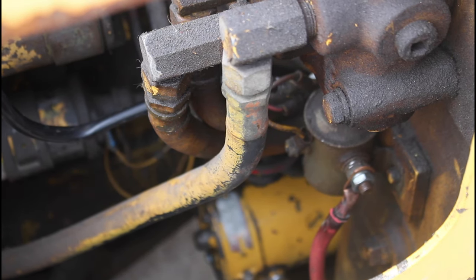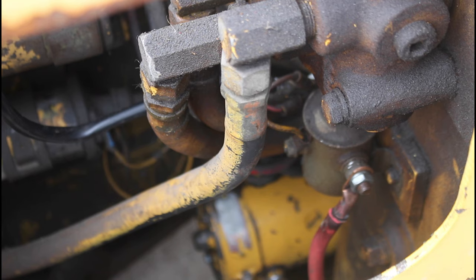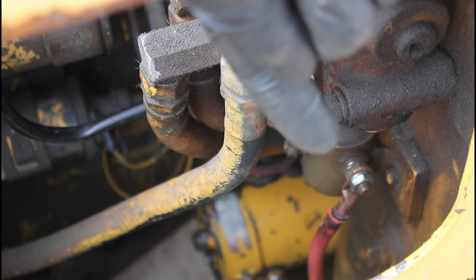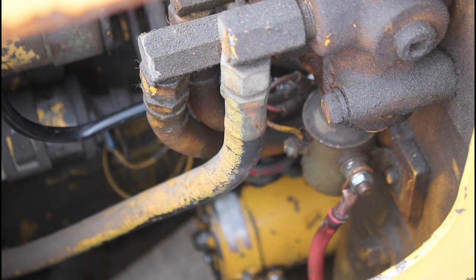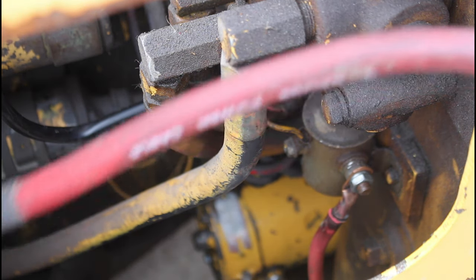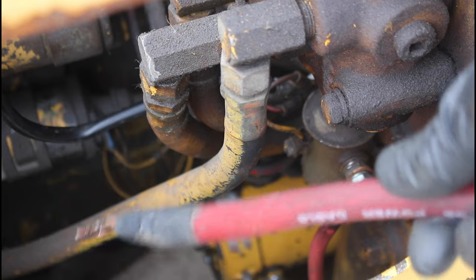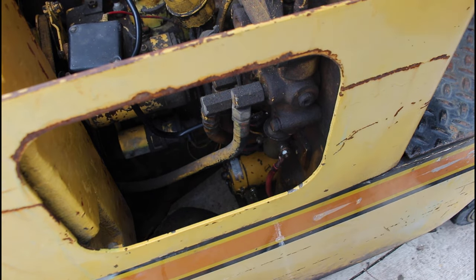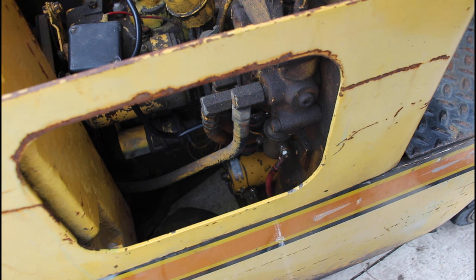All right, so I've been messing around with this thing, and if you can see it there, there is a wire that goes from the solenoid to the starter. And here is the old one, big, huge, thick thing. And we're gonna see if that did anything to solve it. Look at that, that was our problem. Oh yeah, she turns over great now, look at that.